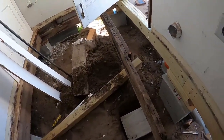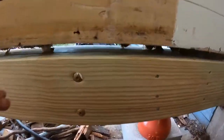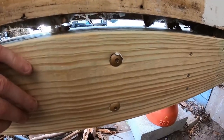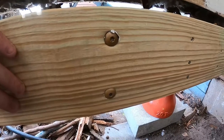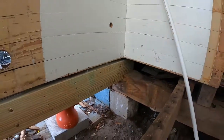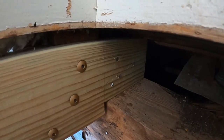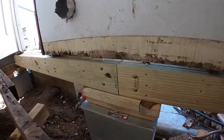Bringing you back here — I've got the final two-by-six in, so that's now a three-plied beam. You'll see I put in the structural screws. I did not put those in all the way down as though I was doing a glue-lam, but you'll see I've got my nails in there as a supplement. Toenailed that corner in up under the house — that's up under the bathroom actually — and then again we're split in the center.